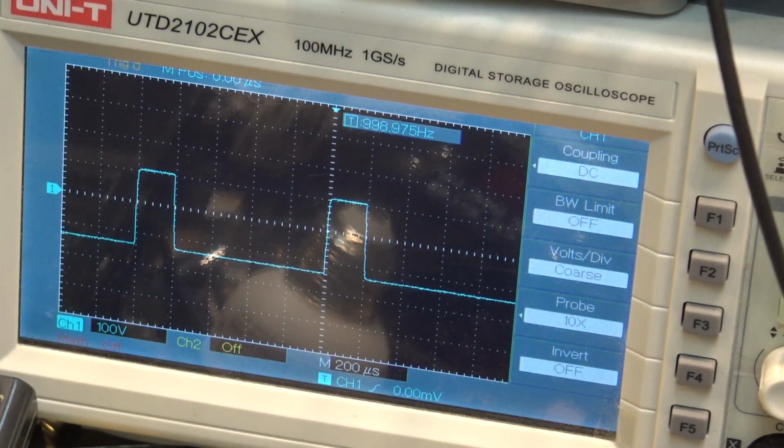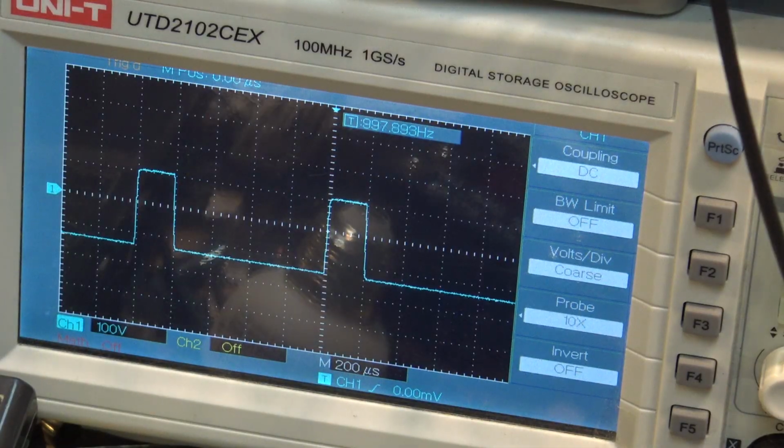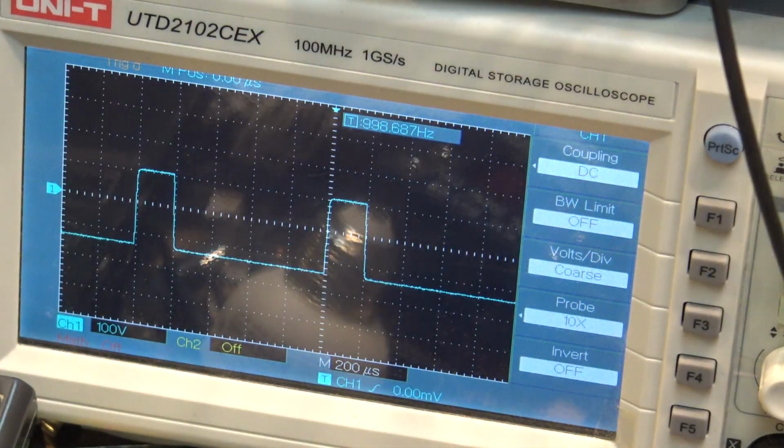This is a 12 amp charger. On the scale, 20% is 12 amps, 16% is 9.6, we'll call that 10 amps. 10% is 6 amps, 16% is 10 amps, 20% is 12 amps, 25% is 15 amps, 30% is 18, 40 is 24, and it's a sliding scale. So here we've got 1/5. If we look at the gradations there, that's 20%, and that's 12 amps. So this is a 12 amp charger, and that's the pilot signal that I'm looking at.